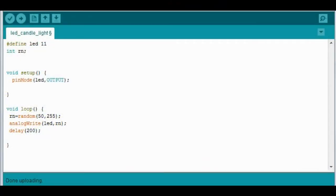I've got the Arduino IDE opened up here so we can take a look at the sketch. As you can see, this is about as simple as you can get. I think the only simpler sketch I've ever seen before is probably just the blinking LED. So what we're doing here first is we're defining which pin the LED light is on. I'm using pin 11, but if you're using pin 10, 9, or whatever, just change that number right there — that's all you've got to do.